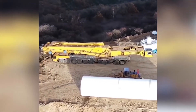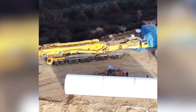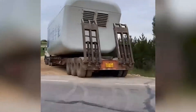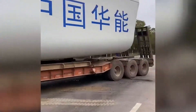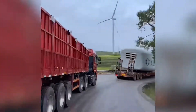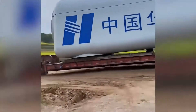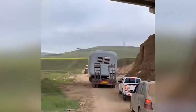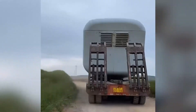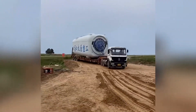Use a large transport vehicle to transport the tower from the manufacturer to the installation site, and place it within the rotating lifting radius of the crane. The placement site of the tower should be as flat as possible without slopes. The two ends of the tower are padded with square wood, and the two sides of the tower are fixed to prevent the tower from rolling. Before the tower is installed, the dust on the double flanges of the foundation ring and the leftovers of the poured concrete should be removed, especially the flanges and various parts.